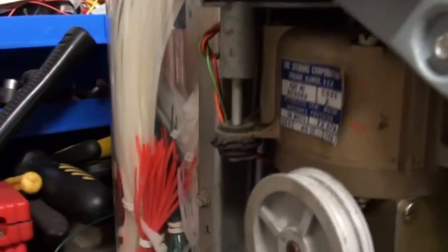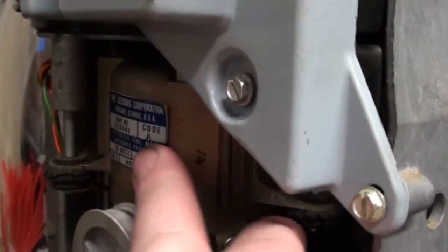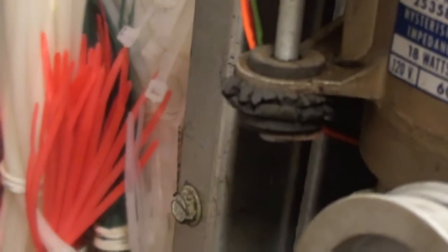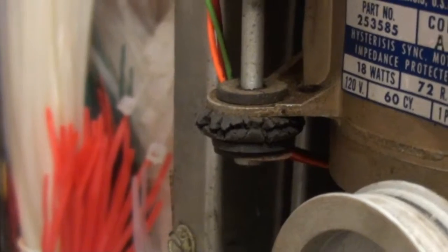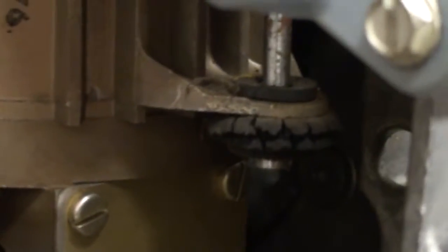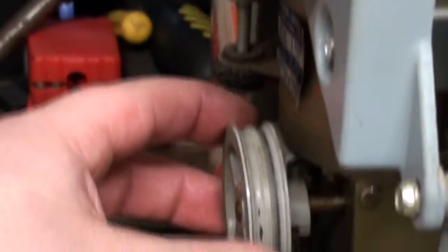Then I've got to take this motor off and probably re-glue this back on so that it sticks better, and replace these little bushings, little bouncing pieces, these little spacers here. I think there's a total of 3 of them. There's 2 that are here, and I think there's a third one that's buried inward, somewhere in there, but I'm not too sure because it's too dark to see. But I think there's another one in there, and that's for this thing here, which turns the platter up here.